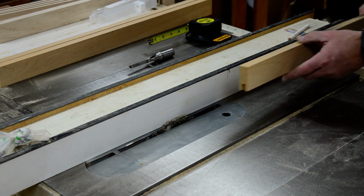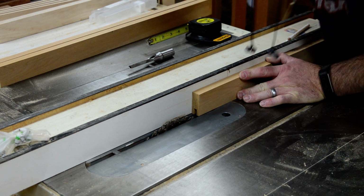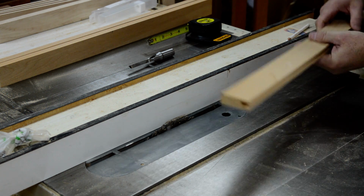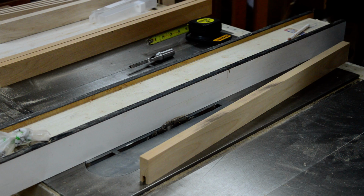All right. I'm going to try just a little bit tighter. So, that said, what I need to do is pull this back a bit and see how we went. Once I've made this cut, I always need to keep in mind that once I've done this cut and flipping it around, whatever adjustment I've made is going to be amplified by a factor of two, right?